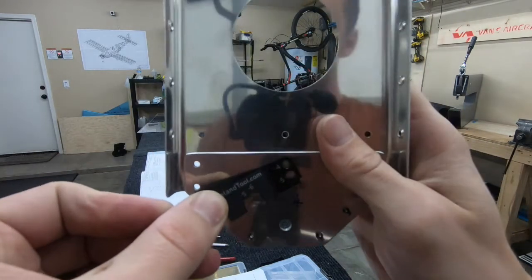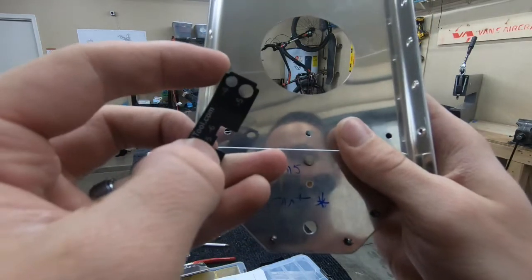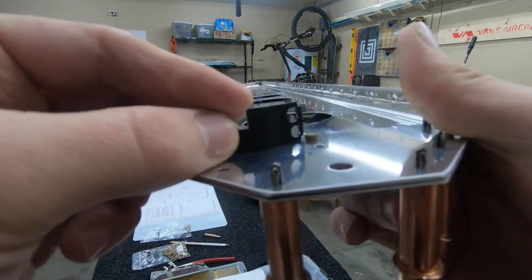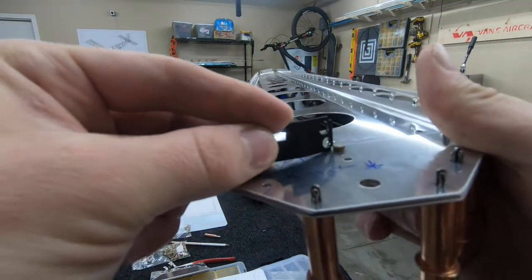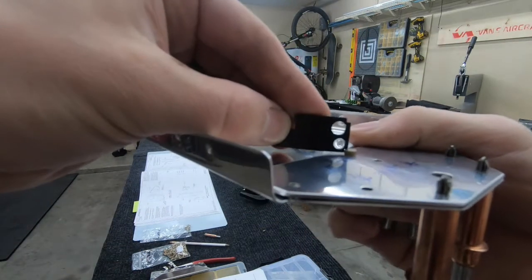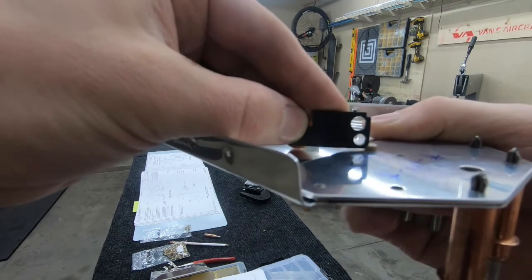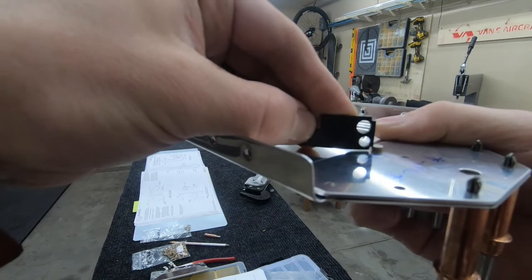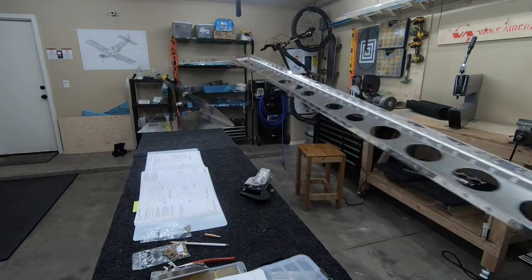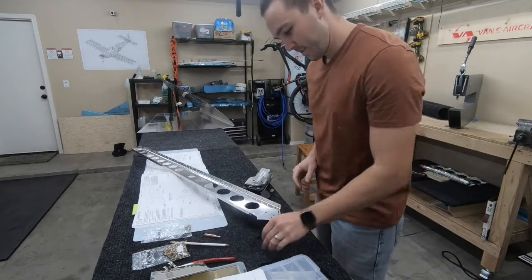You'll see it's sitting at the surface - it's not allowing me to go any deeper. The little notch cut on the side tells you if your rivet is squished too much. You can see a little bit of light in there where it's just about the right amount. I think I could go maybe a little bit more, but I'm happy - this is definitely within spec, which is awesome.